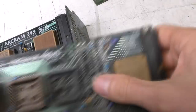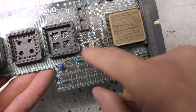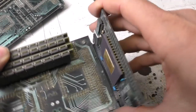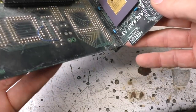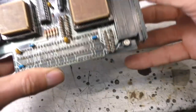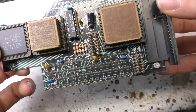And again, all of these had this PAL on here for the software downgrade. The 8 meg had some extra logic on here, I think, to do with address decoding between the two memory controllers. It is possible that not all of these things actually made it into production. It's so long ago, I can't remember. I remember we did quite a lot of variations. I think most of them were actually manufactured, so I didn't have that much contact with the production side of things, so I wasn't always completely in the loop.